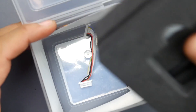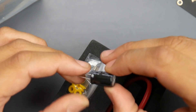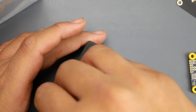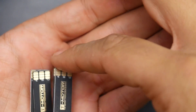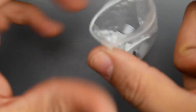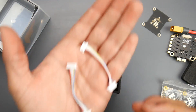Here we have two connectors, four metal screws which are very long for the stack so they should fit most frames, and a nice low-ESR Rubicon capacitor — 35 volt, 470 microfarad. You're going to need this, especially on 6S. They also give us five extra gummies, four PCB wires, spacers and nuts, and even a pre-made XT60 — very thick and long. It's recommended to shorten it about halfway, because the longer it is the more noise will be in your system.